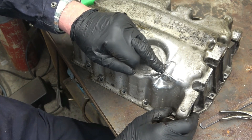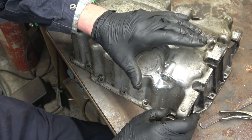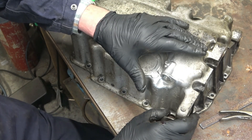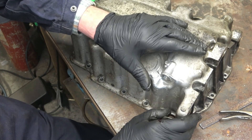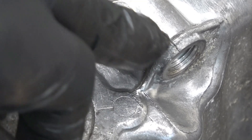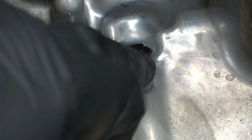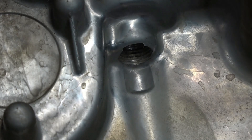I'll bring the camera in closer so you can see the crack. One of the hardest things with welding aluminium sumps and automotive stuff is oil contamination — getting the oil out of the aluminium before you try and weld it. That's the crack, just right there — they always go in exactly the same place. You can see inside there isn't very much metal, but I'm going to build all that up solid and hopefully it will weld quite nicely.